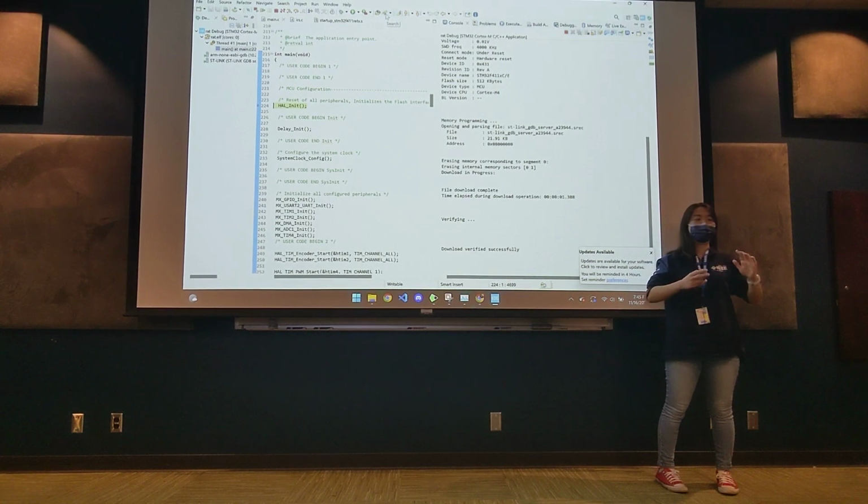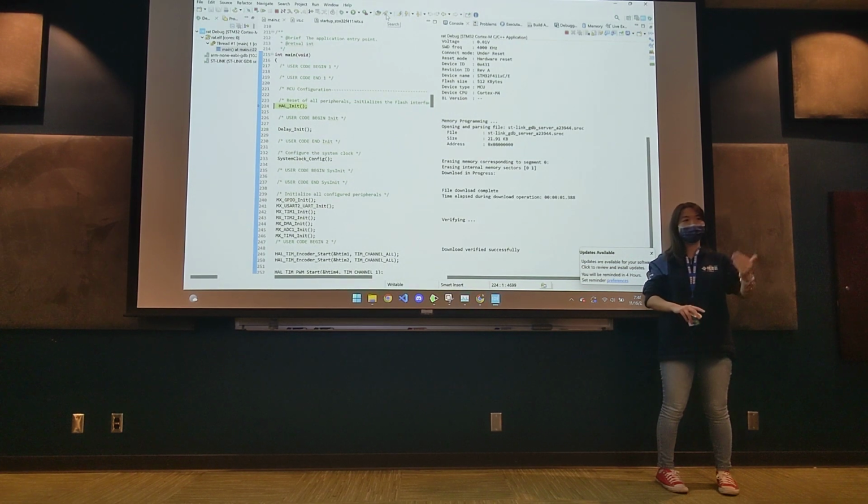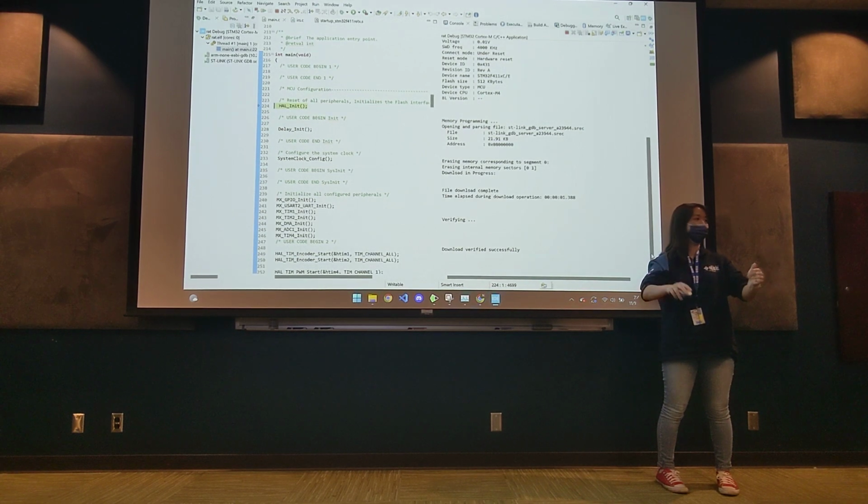That's the other reason why we're taking the average of several readings before using it later in the code, as you guys will do in assignment 4A. It's one part light propagation, and the other part is that the sensor takes a little while to settle when it's constantly reading IR light. Also, there's the time it takes for the emitter to actually start emitting light.